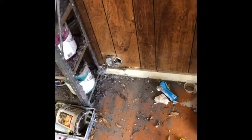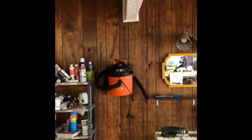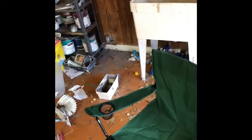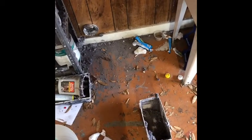Even these fixtures — pretty much anywhere within about a three-foot radius is just caked in this stuff. My options are limited. Ultimately I want to vent it to the outside, but it's hard to do. I can go vertical through the ceiling and the roof, or I contemplated doing a run horizontally over that doorway to the exterior wall, but that involves drilling through brick, and that's a lot of pipe length. I doubt my dryer would have enough pressure to vent like that without restricting the system.